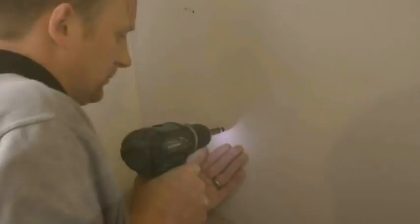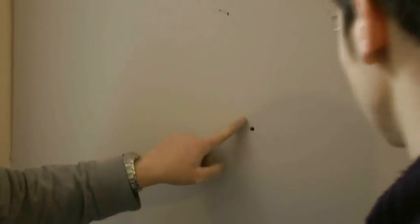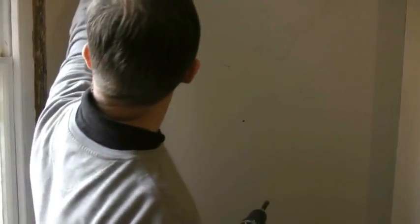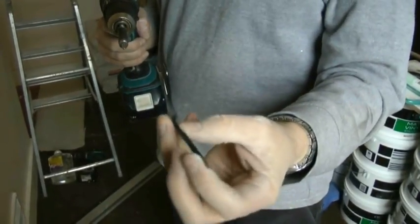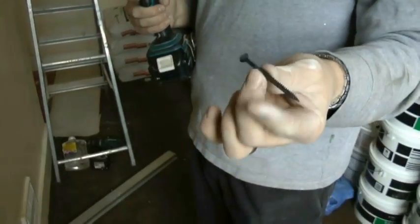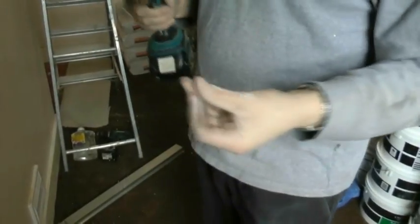As you can see, the wire's in there. This will all go back now and we'll take it from there. Don't go any lower than that — it's sinking in because it's quite springy. Using those black screws, follow the line down — they're called drywall screws. The reason we use them nowadays instead of nails is because they're a lot faster, and you can do this on your own, whereas in the old days with nails you had to get somebody to hold the board.